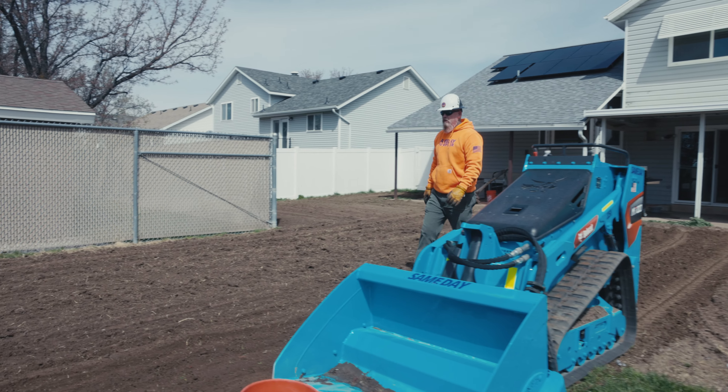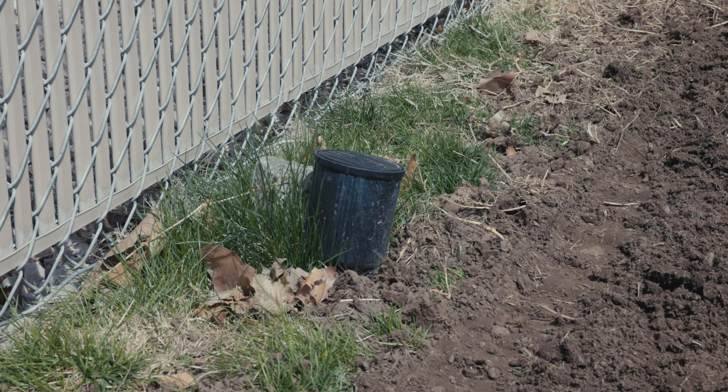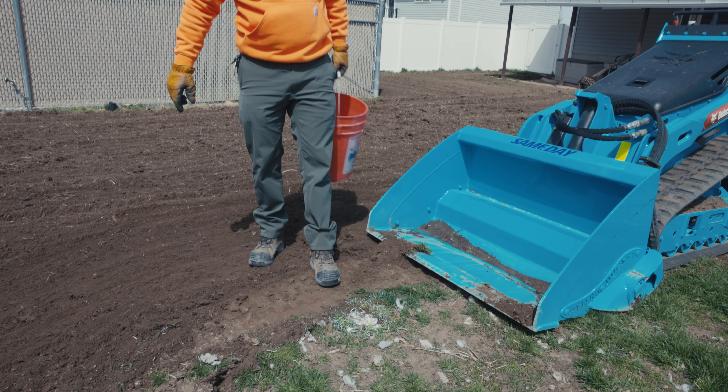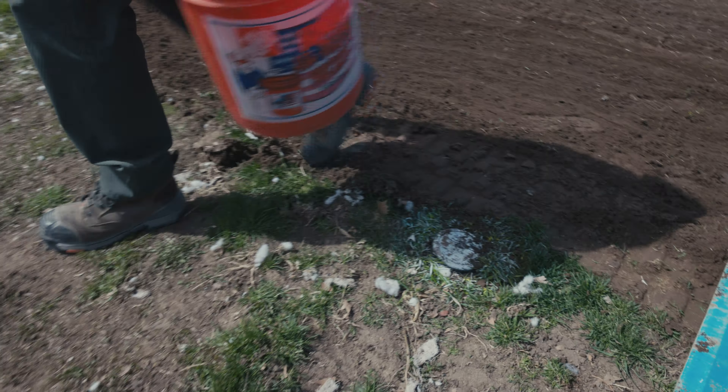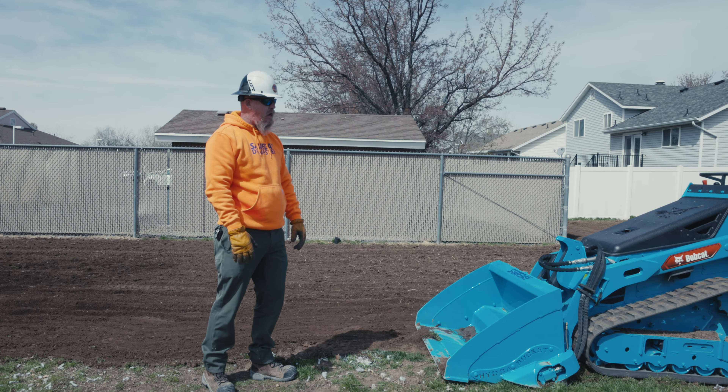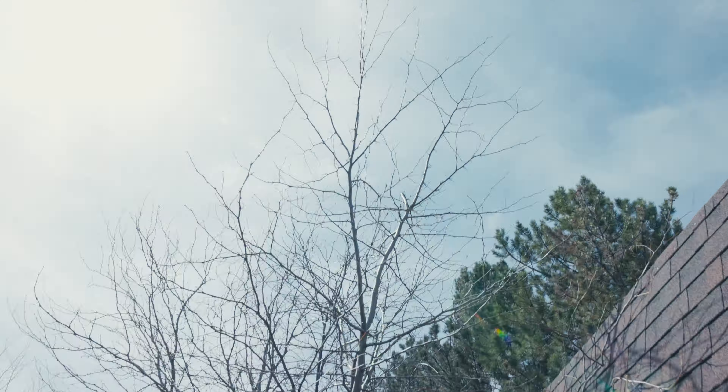One thing you'll see when we do this is I try and mark the sprinklers. This particular yard has them on the sides over here, but in the middle of the yard there's only one. So what we do is we paint it and then mark it with a bucket — that's just a visual for me so I don't run it over. A nice thing about this hydro bucket is it's only going down about three or four inches, so you're usually not going to get yourself in trouble with anything underground at all. We just carve around it, then put the bucket back over the top to mark it as a visual so I know where it's at and don't tear up anything I don't intend to.